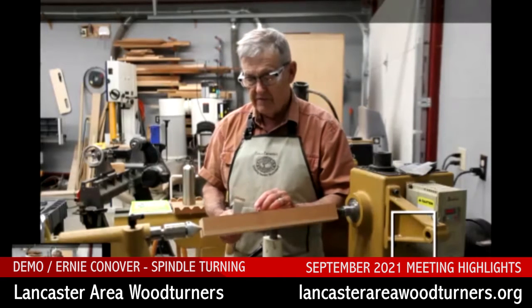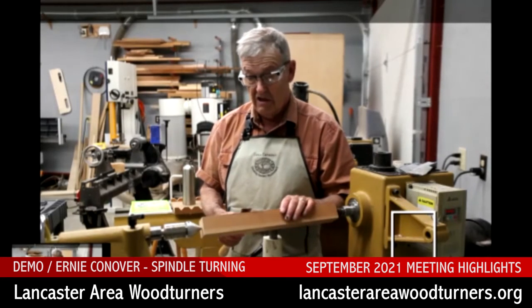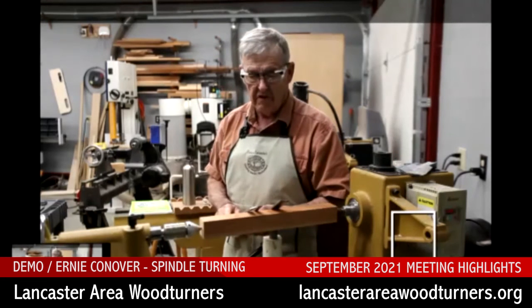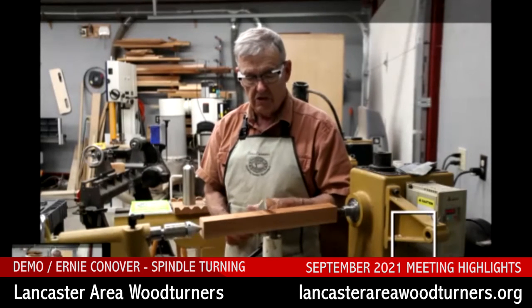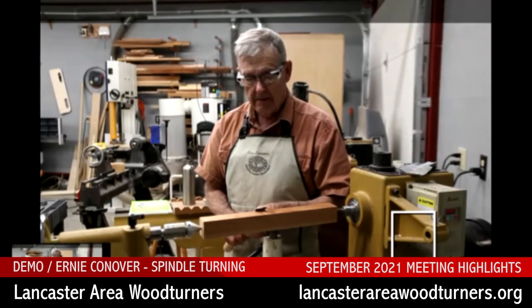I've got this one as a sample from Edward Gandy at Crown, and I started using it, and I just love the thing. I actually have all three sizes they make now. I use them all at various times. They come with a fairly long bevel, but it is important with a skew chisel that it have a fairly flat bevel and not be hollow ground.